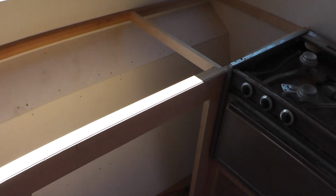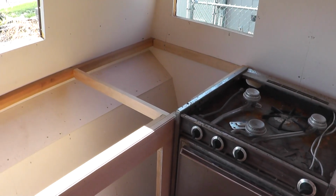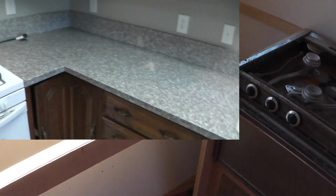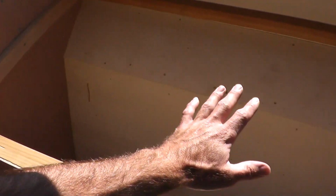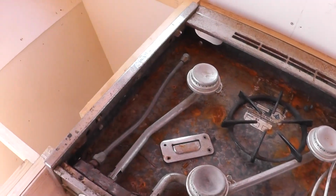I've thought a lot about what method I should use for the kitchen counters and I've settled on a custom laminate job. While I have tried my hand in the past at tile and granite installations, I've never done anything with laminate. So this should be fun. A laminate countertop consists of a particle board base with something pretty glued on the top. So the first thing I need to do is measure this area so I can accurately cut my particle board.